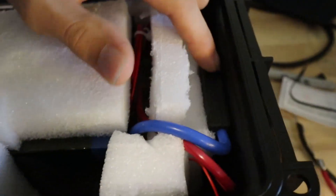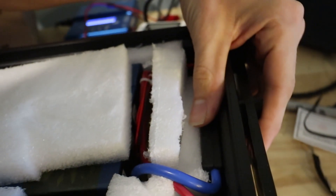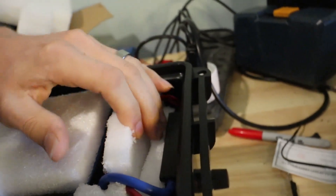I've got the BMS mounted right up against the case of the ammo box with insulation between it and the battery cells, so when it gets hot it's not heating up the battery. Hopefully it's heat-sinking out to the plastic — which isn't a great heat sink — and venting outside the case more than making the battery hot. I've got 10 gauge wire running in this battery, and for the short runs inside I think it'll work fine. The use case here is a 600 watt inverter, which should be max 50 amps. If I were to do it again I'd probably up the gauge, especially if I want to pull the full 60 amps off the BMS.